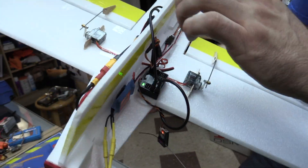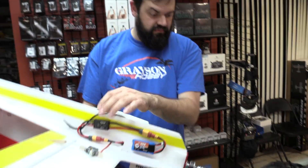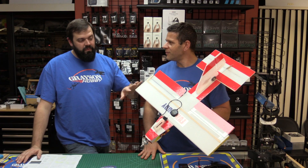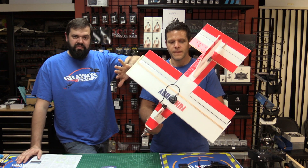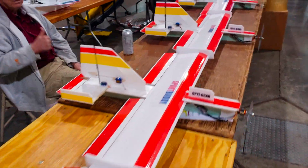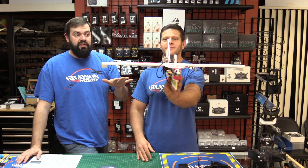So you've got your flight controller, a current sensor, a GPS puck, and it works with Spectrum, SBUS, and PPM. There's also a program card included. In the video we used one of our local's house-built planes — one he's built for a lot of club members. This is a profile plane with very brightly colored surfaces and extra throw so we can show you how to set up this gyro, because on a normal plane the movement might not show up clearly on video.